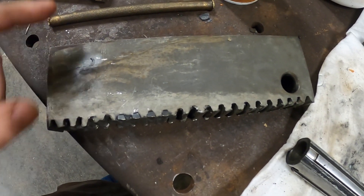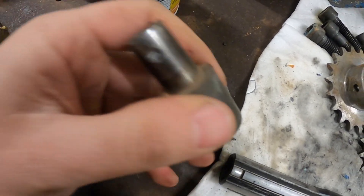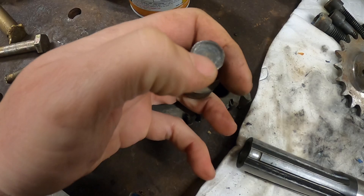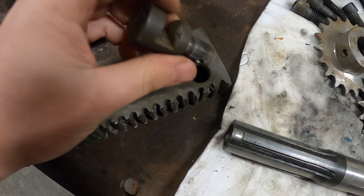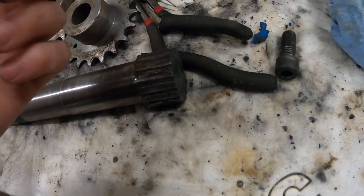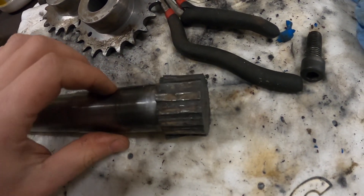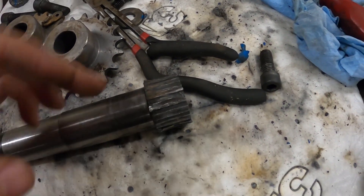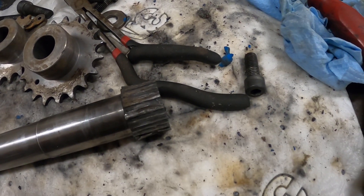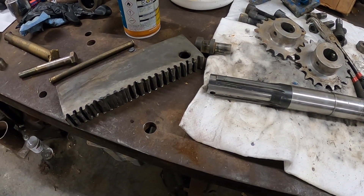So I'll reuse the existing piece — since it's already drilled and tapped in the correct alignment and location — as my shim block. I still have to drill and ream for the lifting eye if I want to use the same mechanism. I could also drill and tap and retain it from behind, but I'm running into clearance issues on the back side. Same for the gear — I thought about splining or drilling and tapping to hold it, but there's a clearance issue with how close this is to the pair of counterweights for the counterweight assembly that lifts the head up and down.